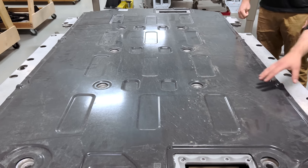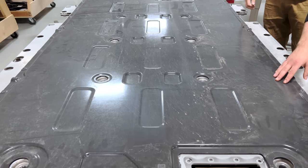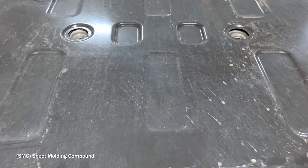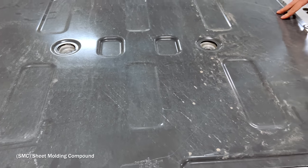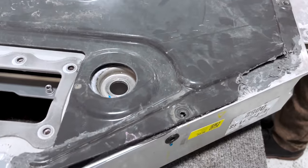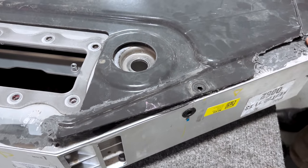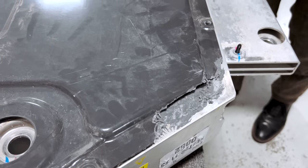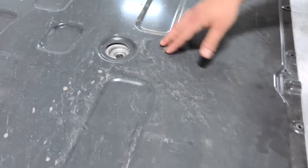What we're seeing right now may have been visible in one of the hoist reviews we did for the vehicle. This is an SMC cover closing out the bottom portion of the battery pack. We had to remove this with a series of fasteners and also a good bit of structural adhesive both around the perimeter and around any areas where there was a bolt going up mid-pack to the body.